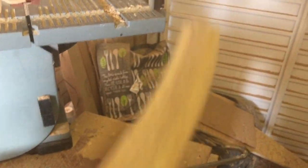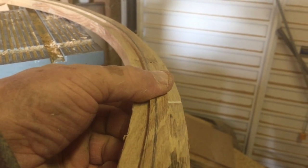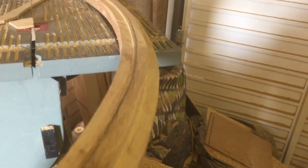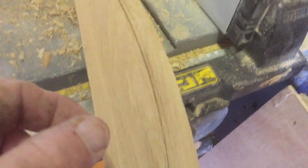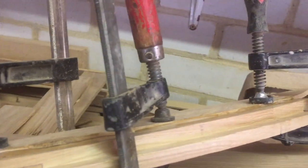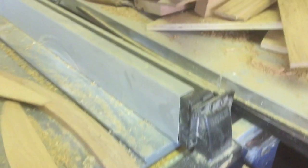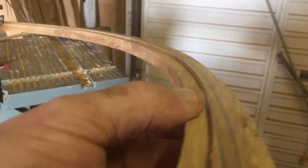I started routing out the groove for the top arch — the last piece of the frame — and after I'd started I realised I'd done it on the wrong edge, the inside edge, which is no good. I basically mucked it up. Rather than make new pieces, what I've done is cut thin strips, glue them into the wrongly cut rebate, let the glue set, then machine it out. Here's one already in the clamps. It's a bit of a blow and set me back, but in this game you've got to know how to get over things and think on your feet.